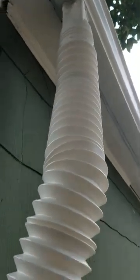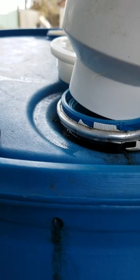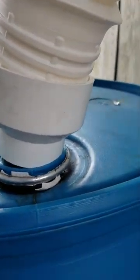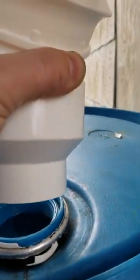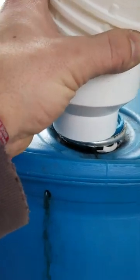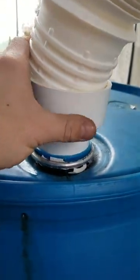I put it back here because, as you can see, here's my garage — it's going to hide most of it from the neighbors. This is a three-inch to two-inch reducer with some flexible pipe that I put up. You can see the hole right here. I'm going to do this in a different fashion because it fits and kind of slips down, but there's a lot of pull. For now I'm going to tape it, but what I'm going to do is get a piece of two-inch PVC, let it run long in there and glue it so the force keeps it from pulling back.